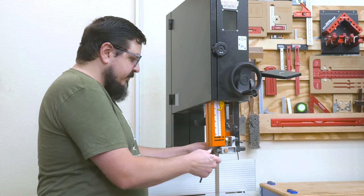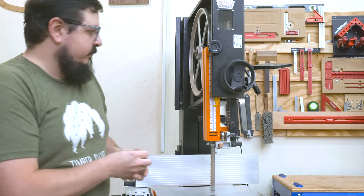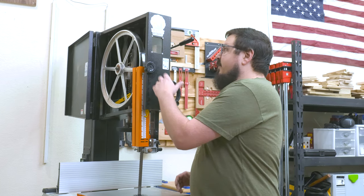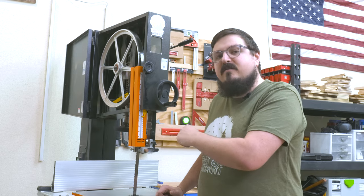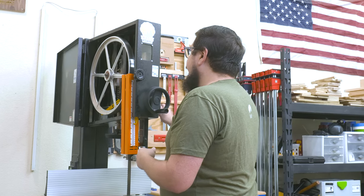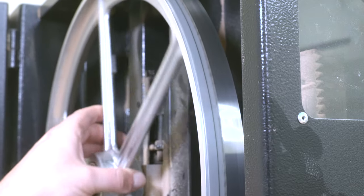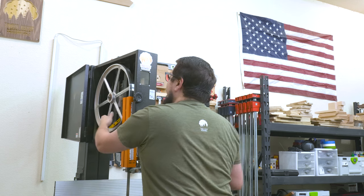The first thing I'm going to do is loosen up all of my guides and release the tension on the blade. Now, a lot of manuals will tell you to have the blade centered on the wheel, but in this method you actually have the gullet centered on the wheel. So we're going to add a little tension to the blade and I'm just going to spin the blade with my hand, looking through my viewfinder, and adjust the blade until it sits dead center on the wheel on those gullets.